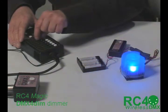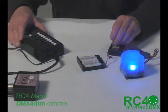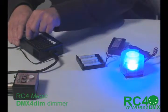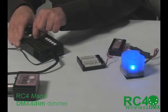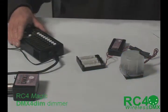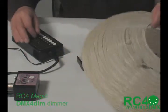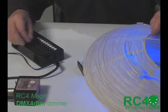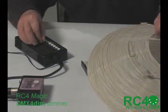Now if I set my DMX level to around 40% and reset that, we now have the inverse square law curve, which is what I was using in my earlier demos. Here's the dimming in the upper half. At 50%, it really does look like it's 50% bright. I can make it a little easier to see if I put some additional paper diffusion over it. So we can much more easily see now — here's the top 50% — and you see that is quite a good linear response.